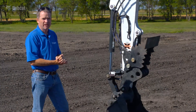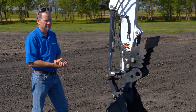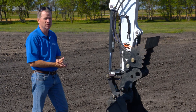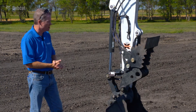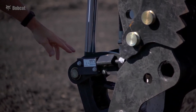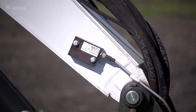Today we're going to be talking about the Bobcat depth check system. The Bobcat depth check system is exclusive to the Bobcat excavator — it relies on componentry that is standard or optional equipment on Bobcat excavators and needs those other items to function. From a component standpoint, depth check includes a sensor on the bucket linkage, a sensor on the arm, and a sensor on the base of the boom.